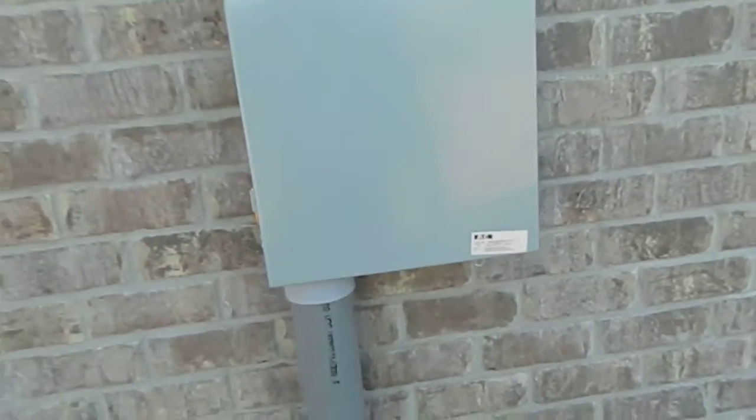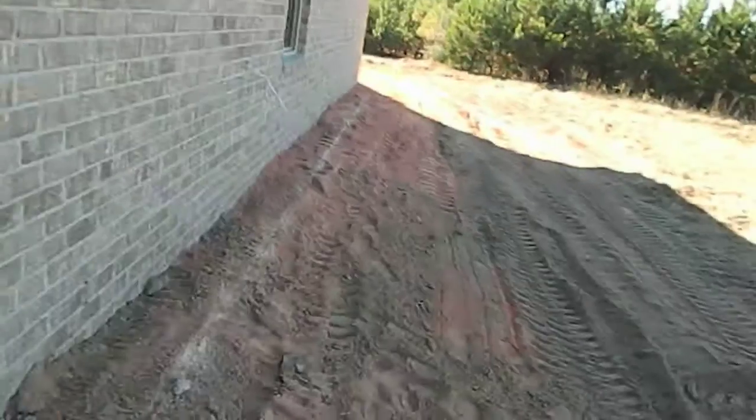You'll have a main breaker for your air conditioning unit. You'll have a breaker for two or three other units, and you'll also have a main power switch. This is the main kill switch for the entire house running inside the house. There is a connection for a lock down here — do not lock it, because if there ever is a fire at your house, the electrical company will need to have access to come out here and kill the power to be able to put out the fire.